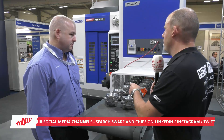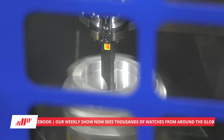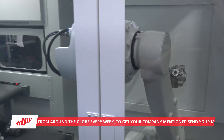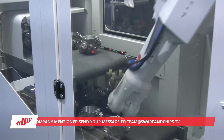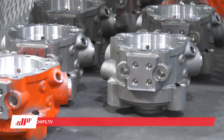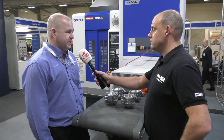When you take the brother machine, I'm not surprised they've introduced this FIDO automation solution because the machines are so fast you need to keep feeding them. I suppose that's why they've called it this. We need to keep feeding them, and obviously with robots, the robot never tires. You have an operator on there but you just can't keep up with the speed of the machines because they're so quick. Can you fit this FIDO solution to any of the brother products? Could you retrofit it to a machine? Yes, we can retrofit this to any of the machines - it will fit to any of the brother ranges, whether it's twin pallet or single pallet machines.